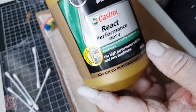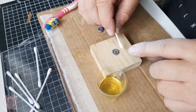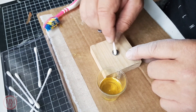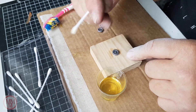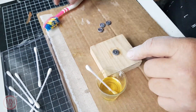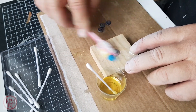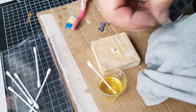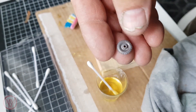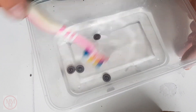For the wheels, I'm using some brake fluid and a cotton bud to remove any remnants of paint. This will make the wheels look brand new. It's a bit frothy — probably residue from toothpaste off the brush — but afterwards they come up clean. I give them a bath and then spray them with Tamiya top coat to make them look new.